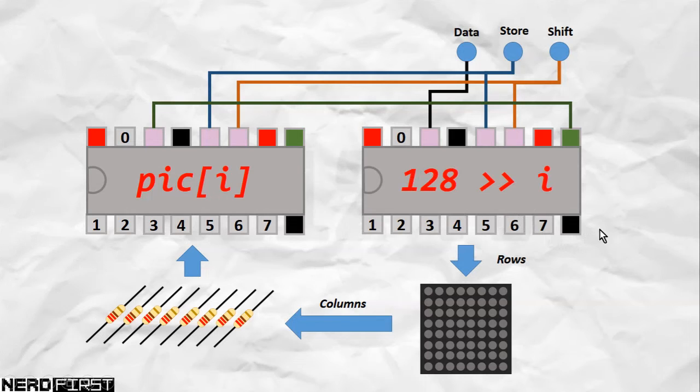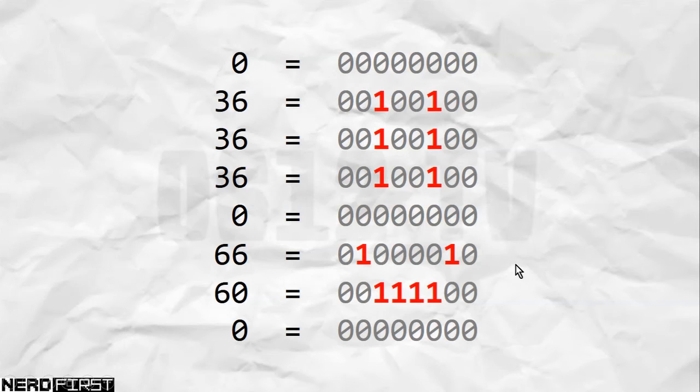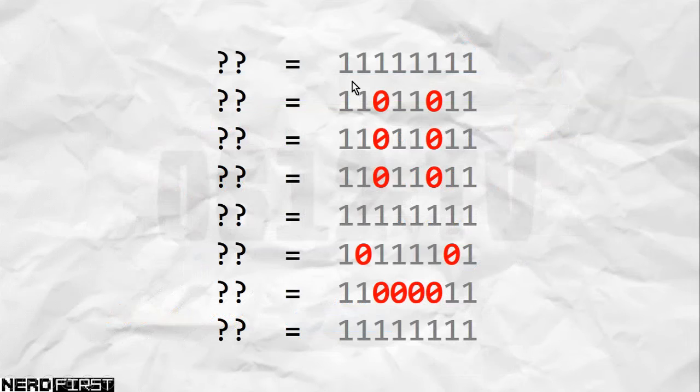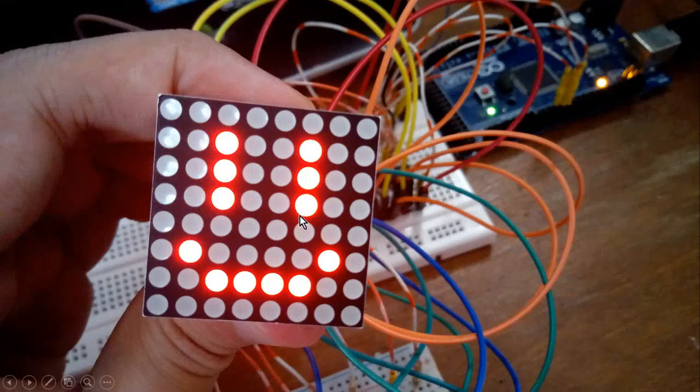We should have everything working just fine. As it turns out, something weird happens - our image actually becomes inverted. What we're sending out on our second chip is a one when we want a particular LED to be lit. However, don't forget these are the columns - we want to use these pins as sinks, so they have to go low when we want an LED to light up. This means in our array we have to flip the values around: when we want a pixel to not light up it needs to become 1, and when it's 0 the pixel will light up. Thankfully there is an operator that can help - the tilde operator - which simply flips every single bit within a number. By making that one little change we get our little smiley face.